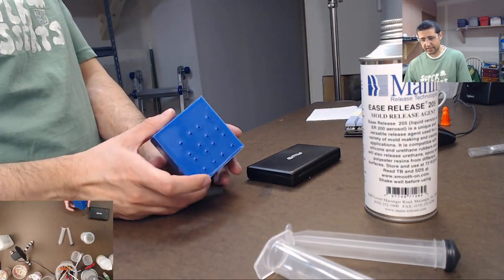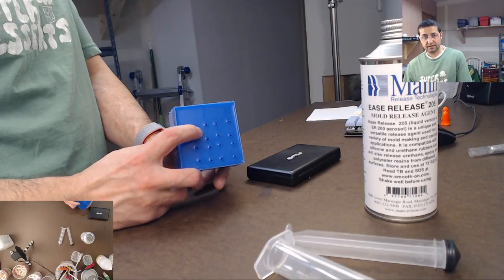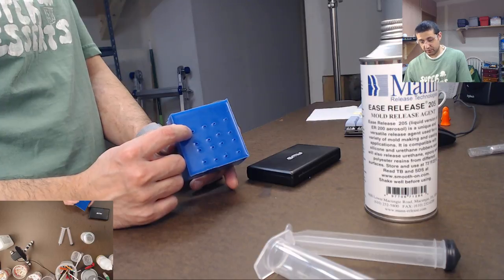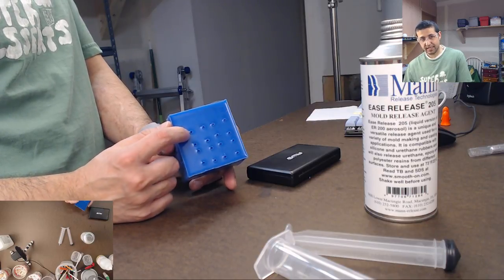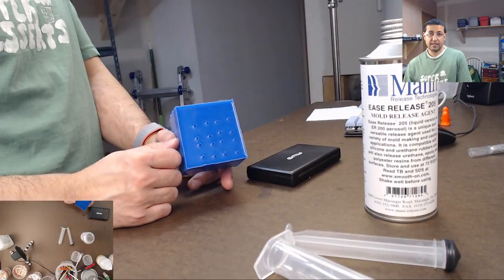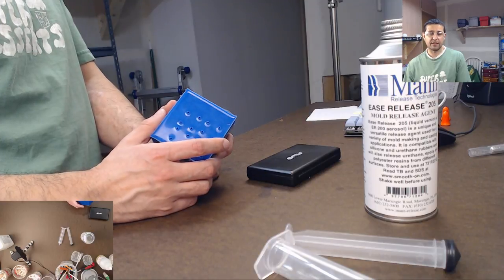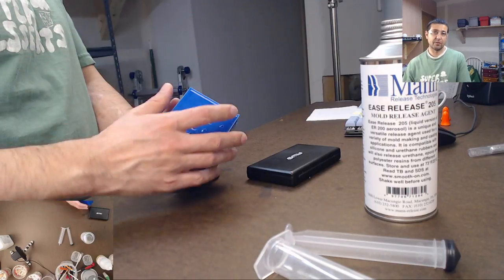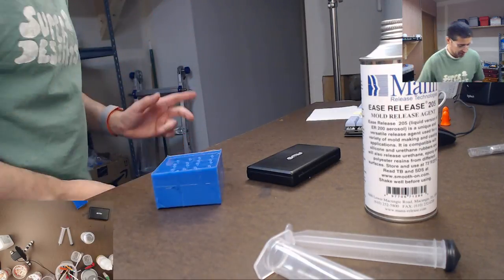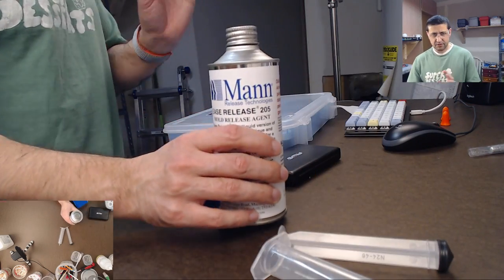So you've seen the way that I do these sprues here, and what you need is a reservoir of resin. If you don't put enough resin in there and you put it under pressure, air bubbles are gonna go inside these sprue holes and they're gonna get stuck inside your keycap. And that happens all the time. I end up having to throw away 1 or 2 every time I do a casting because of the air bubbles. But the synth, the way the synth is designed, and actually, I'll show you one. I'm kinda going off on a tangent. Let me do this one first.